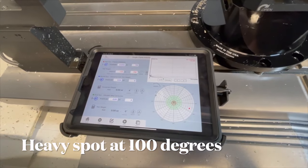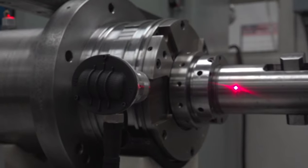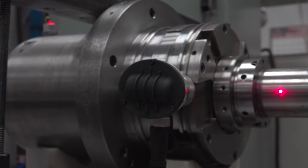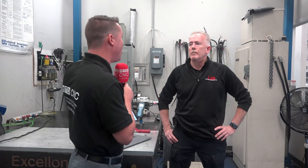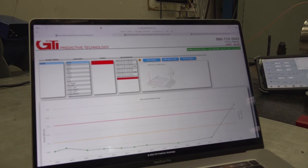Let's talk about the Bluetooth capabilities. Previously, all I had ever seen was a wired situation that would connect, and sometimes that would get in the way of tool changes, or sometimes I need to remove it from machine to machine. Now you can connect 20, 30, 40, 50 of these based on how big your machine shop is with a base that it connects to — all these sensors constantly collecting data for everything around the shop. Absolutely. So we can see any condition that might be impending. There might even be a bad tool in the tool rack that's imbalanced causing finish issues — all the things that you're going to be able to detect in a health environment.